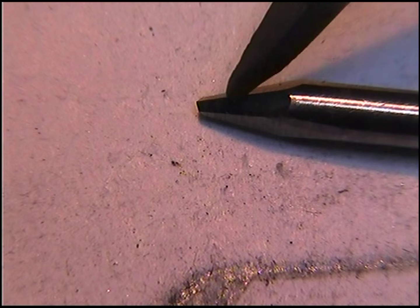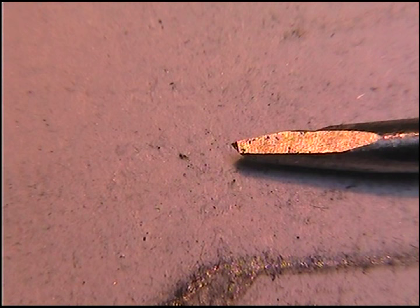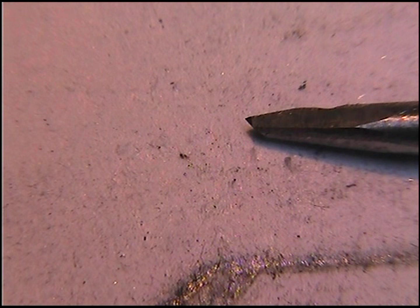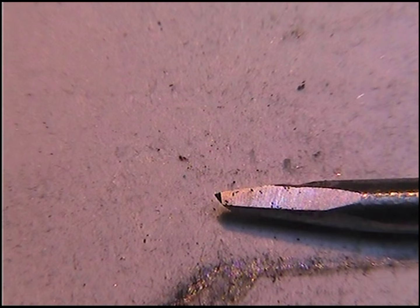You need to get a very polished graver. I normally use carbide, but I've just experimented with high-speed steel and it sharpens really quickly. Carbide by hand can take 40 minutes, but high-speed steel is done in five or two minutes by hand, or no time with power. It doesn't hold as much polish as carbide, but it works quite well. Now I'm going to go over how to get this result.